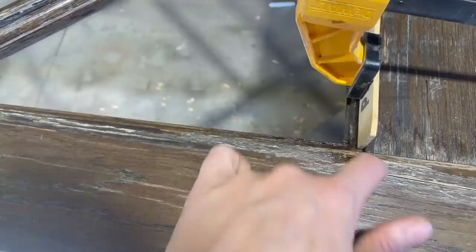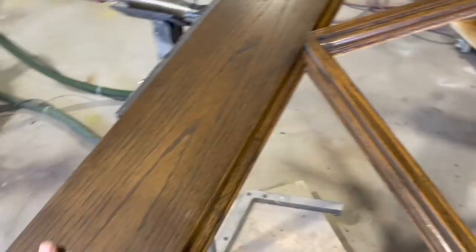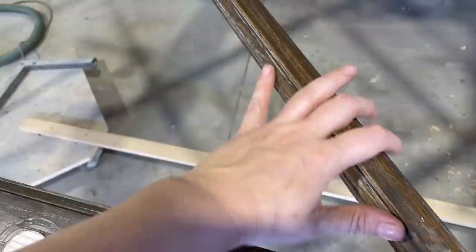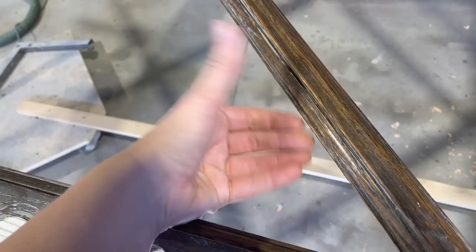Even though this was on the inside, it still saw quite a bit of water damage, probably coming in, you know, through all the joints. So the wood will always be better up top here where it didn't get too much, but we'll try to blend everything in. And the reason why this is supposed to be the exterior, because this is one piece, if you didn't understand what I was saying before, this is all built out of one piece of wood. So if water penetrates or gets onto this piece here, it just doesn't have a seam here to get into behind this little piece of trim and then warp it and sit back there.